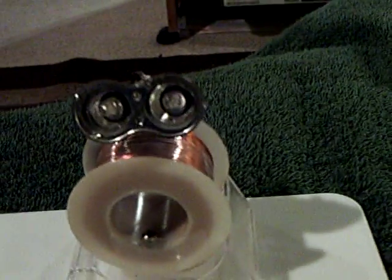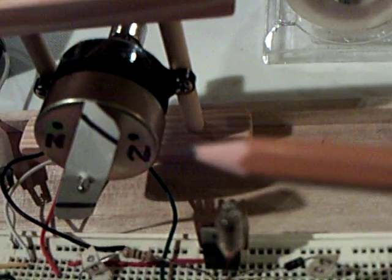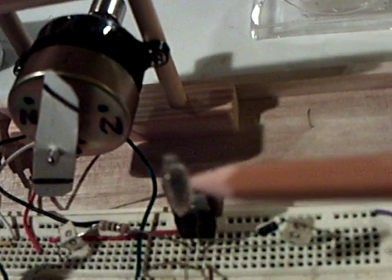I'm going to show my little magnet junkie friend running off the magnet that is mounted on the back of that motor. I've wanted to do this for a long time - just mount the magnet on a motor and see if I get the same kind of results. And then I'm going to show the charging that takes place now that I've rewired it on the flyback. When the coils collapse on that motor, they shoot out a high spike of energy. I'm going to show that in the neon that lights up at 60-some odd volts, and then I'm going to show the voltage being stored on that capacitor on this meter right here.